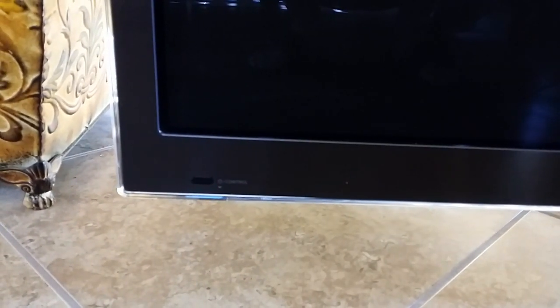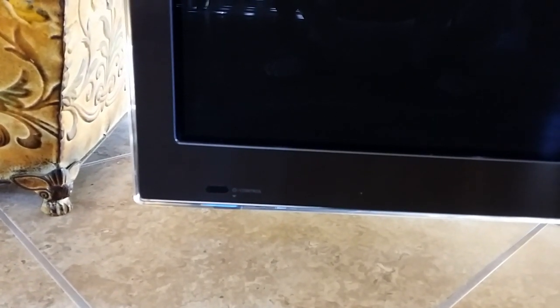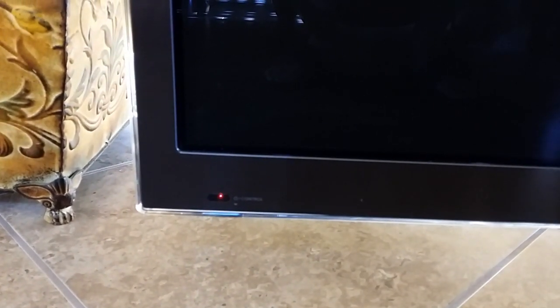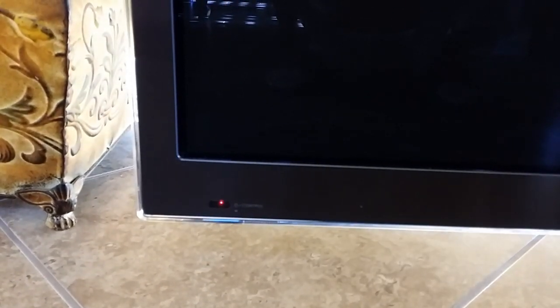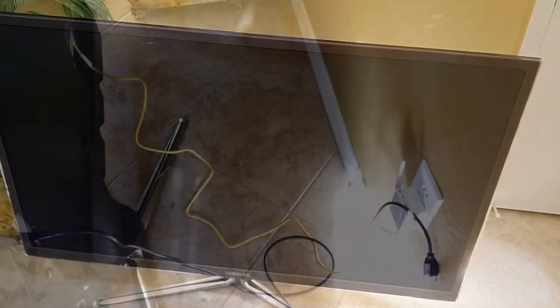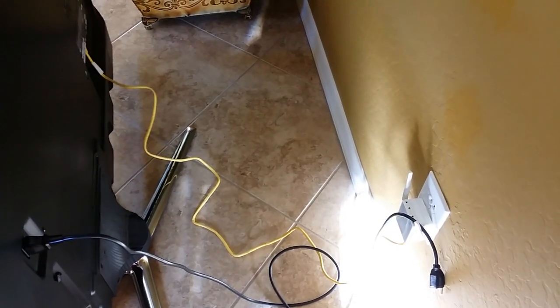I have a feeling this was a premium top-of-the-line Samsung model back in the day. If there's one thing that plasma TVs do well, it's that they generate deep blacks and very high contrast images — almost like an OLED screen on new smartphones today, certainly better than LCDs in terms of image quality. The only thing I don't like about plasma TVs is that they generate a lot of heat, and this particular model consumes a typical 143 watts with the screen brightness turned down.